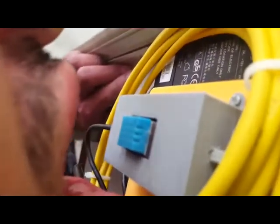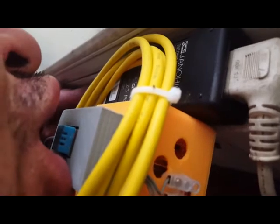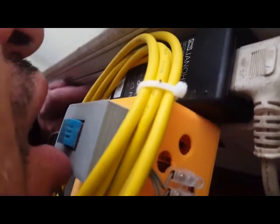And here I have two limit switches, one for closing and one for opening. Those move alongside the window. And if I breathe on top of that sensor, it will increase the perceived relative humidity, and that is what triggers the motors to move. So that orange box down below has two 12-volt relays driven by two transistors, and also by some optocouplers, and those are connected to the 3-volt outputs of the NodeMCU, the ESP8266.